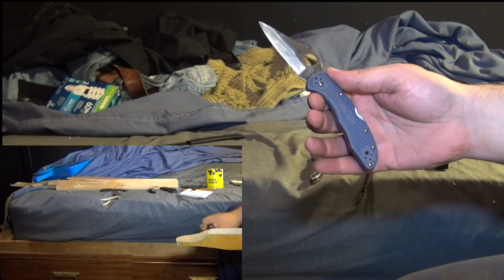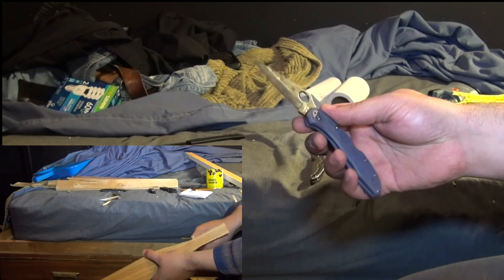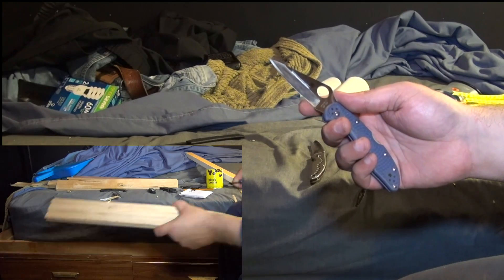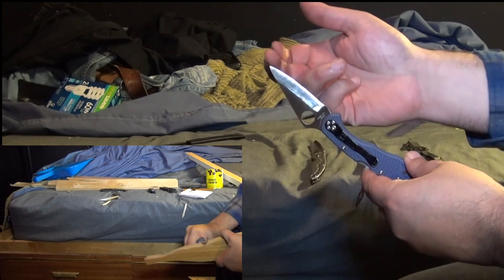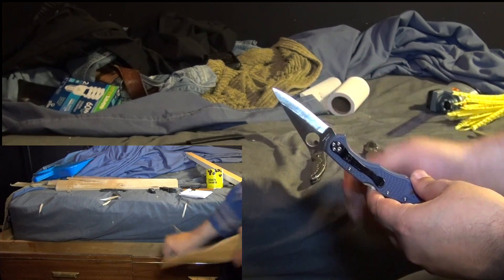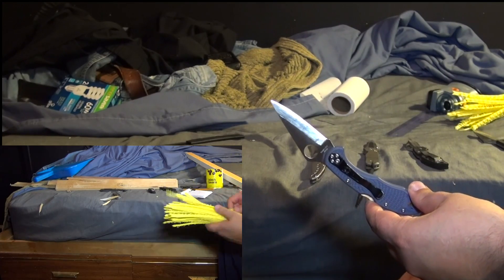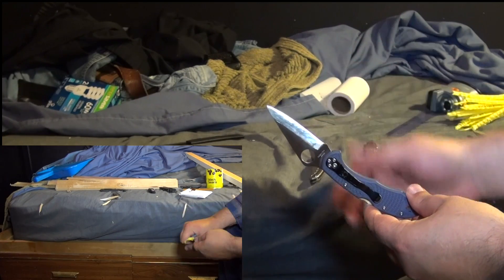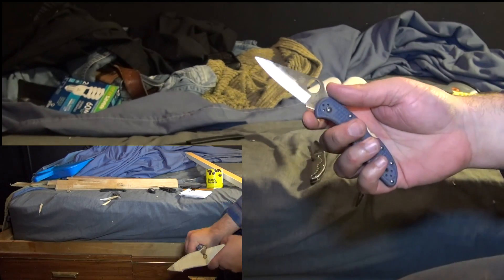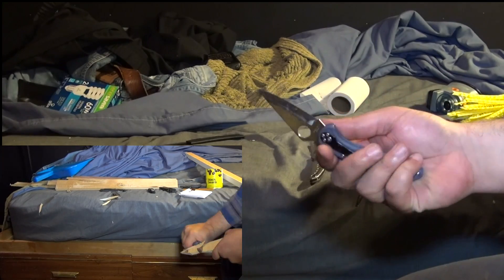This is one of the areas to consider when matching a steel to what you're actually doing. ZDP-189 is a very high wear steel but it doesn't have very high edge stability. What I'm talking about is fracture occurring at a steel thickness of around one-thousandth of an inch. What's happening is you're seeing fracture in the steel because that's the size of the carbide aggregates in it. Steel cannot stay stable in cross-sections of the order of the carbide aggregates, because there's no actual steel around the big chunks of carbide to hold them in place.